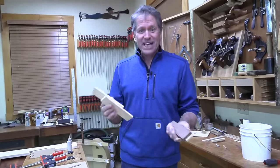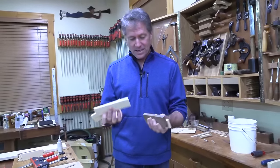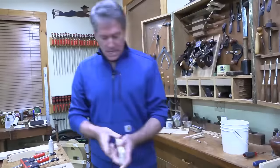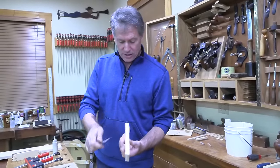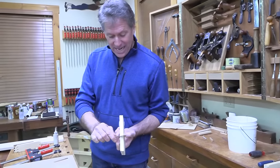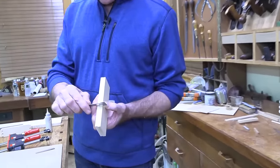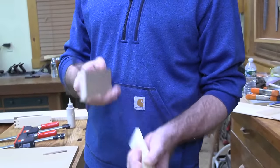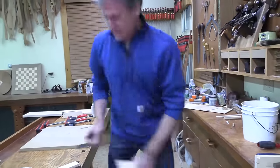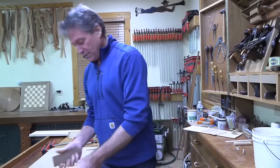The fun thing about small drawers is figuring out how light you can make the various elements. You can go pretty small and have a nice operational drawer. With my drawer sides — here's a little trick to measure narrower things: put two together and measure across. I'm a 32nd over five-eighths, so that means five-sixteenths strong, a 64th on one. They're five-sixteenths generally thick. The drawer front I made nine-sixteenths thick. Pretty thin material, but that's what we're going to go with.